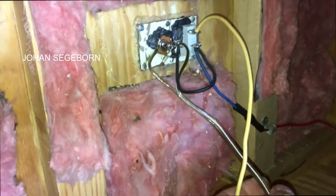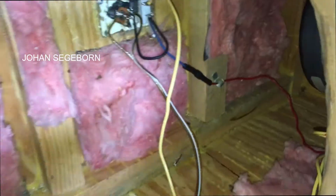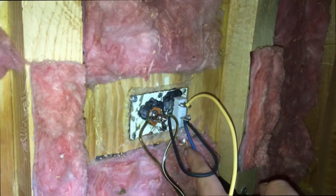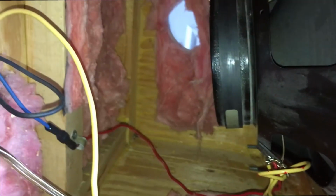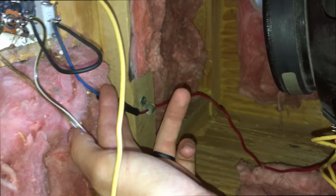Anyways, this is how I got it wired. I got the signal coming out of that output jack going straight to this speaker here without any manipulation. And then I got a toggle switch over here where, off of the hot post, I can either have the unaltered guitar signal go to that speaker back there, or I can have the diode that I have here inside of heat shrink part of that sound.